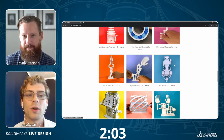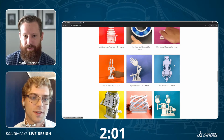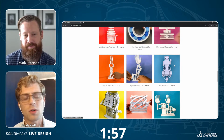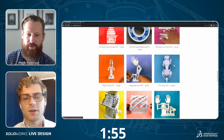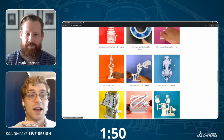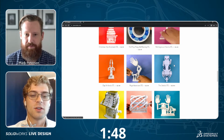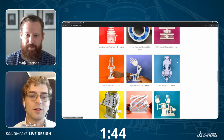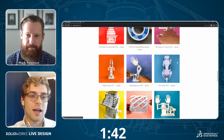The simple answer is, if you want something to spin around with free motion, I typically go with 0.2 millimeters clearance. For most hobbyist printers, your Ultimaker is definitely within that range. If you want it to be tighter and you want more friction, drop down to like 0.15, 0.1, and the lower you get, the more friction you're going to get.